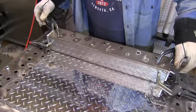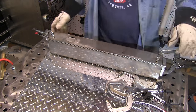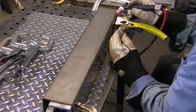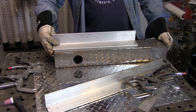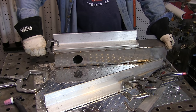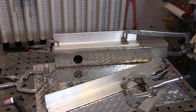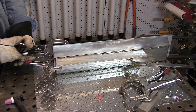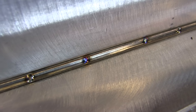Once I got the two halves together, I'm going to weld it all up using backing after I get it tacked, and then I'm also going to add chill bars. It takes a lot of clamps to do this — a little bit of effort, but it's very much worthwhile. I'm a little concerned about distortion with this much welding on stainless steel, so I'm going to really spend some time making sure all these corner joints are backed up with an angle on the inside with a good fit. It's probably helping by slowing me down a little bit and keeping me from getting in too big a hurry and overheating anything. This is going to pull a lot of heat out of that stainless steel — it's worth the effort, definitely.